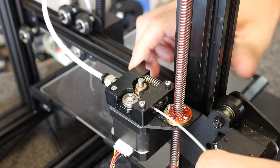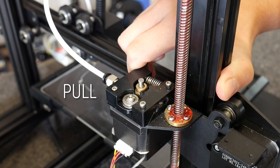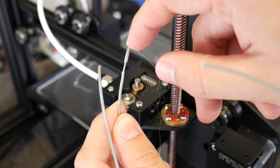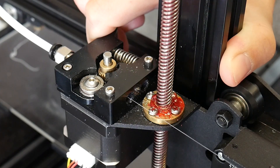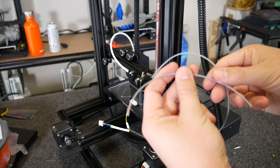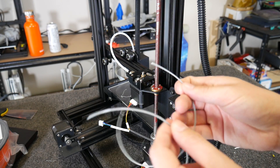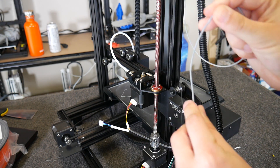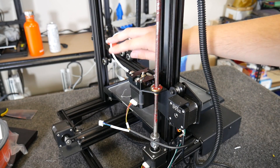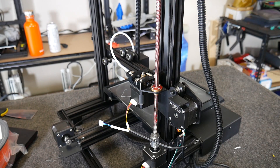At temperature, I'll push down the tension lever — not too much, or it jams — push filament forward until it extrudes, then pull it quickly back. See that gunk that came out? That's what usually causes the jam. There's all the wispy stuff that came out behind it — that's stuff you need to carefully remove, which is why extruding first and then withdrawing is highly recommended. Also notice it snapped. PLA can become very brittle when left in the PTFE tube. If this happens, keep extruding new plastic in to force the old plastic out. If your filament is very brittle, withdraw it after every print instead of leaving it in overnight.